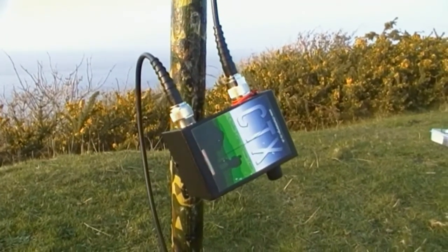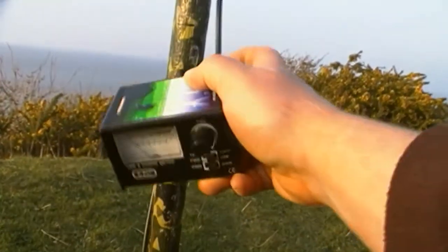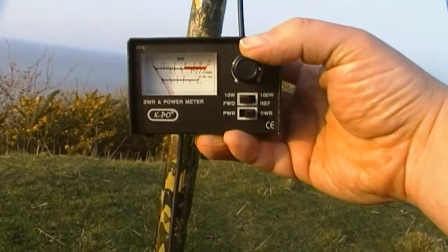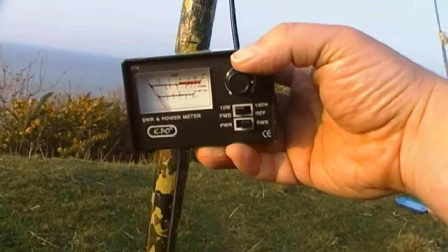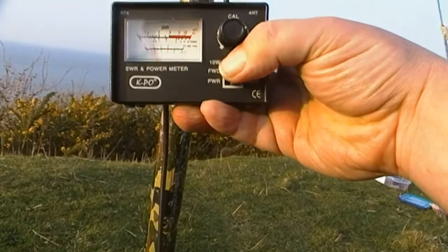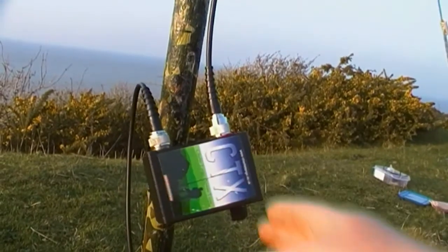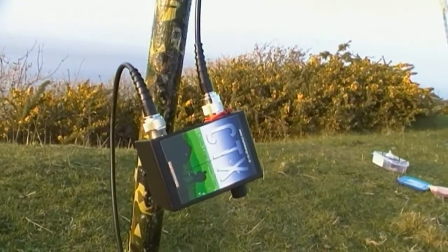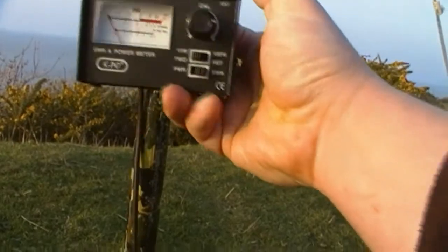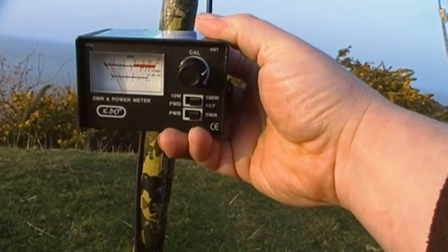It's an extra test — I'm going to test the SWR at the very base of the antenna, just beneath the coil at the PL259. So instead of coupled into the feeder, I've introduced the SWR meter. Without further ado, we shall see what it is on mid-block channel 1. It's on the mark — and it's 1.6, which is pretty close to where it was at the end of the feeder. Go up to channel 40 on the mids — that's 1.3.